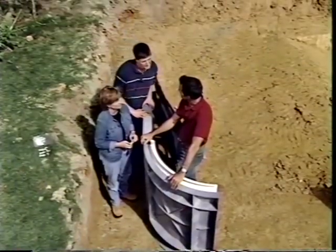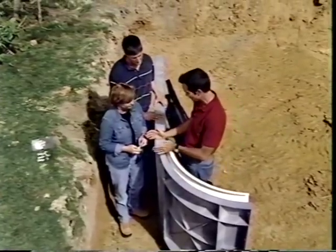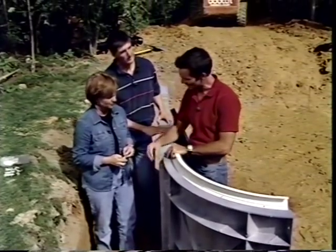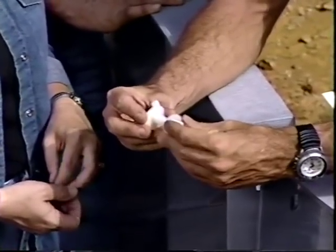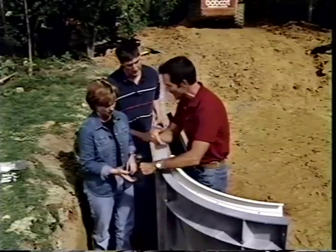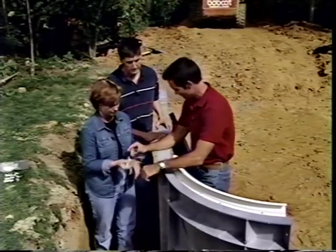Assembling the wall is straightforward. There are three elements to each seam: a right side, a left side, and a brace that goes behind. The fastener has two washers — one on each side — and is tightened down with a wing nut. Once all are hand-tightened, a final pass is made to make adjustments.